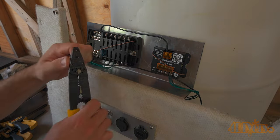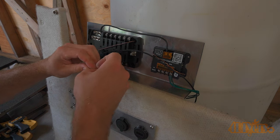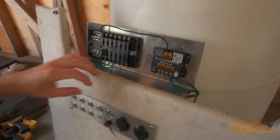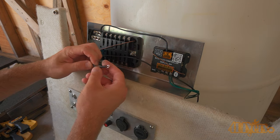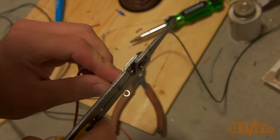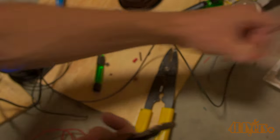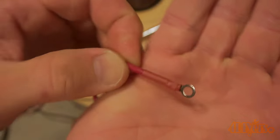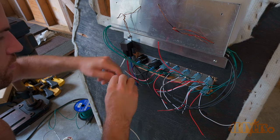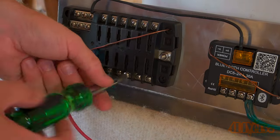There are different zones for each switch, toggled through the black wire from the LED pigtails. The red, blue, and green RGB wires are always connected to the module. This fuse box is equipped with a ground hookup as well — a boat isn't like a car where the body is the ground, so I'm required to run my own ground wires. I used eye terminals for all the fuse panel connections. The pre-installed plastic insulator was removed, the wire stripped back, color-matched heat shrink installed, the terminal crimped, and heat shrink put into place. I prefer the heat shrink as it provides a cleaner look, better protection, and lower profile. The only relay used was for the USB and cigarette lighter ports as they have higher amperage on those circuits. Finally more terminals are fastened into place for the fuse panel.